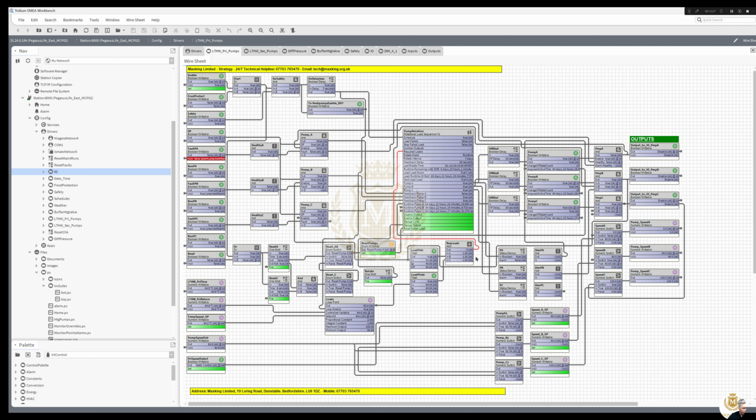We will always go to 3 pumps, because the HIUs require 60 degrees. We're giving it 64 at the moment. We couldn't really lower that set point down any more than what we've already got. So that's controlling the loads using pump rotation.